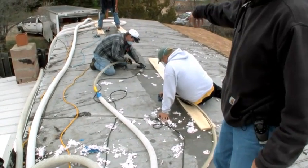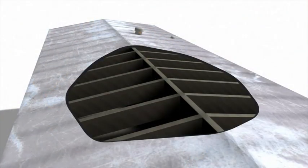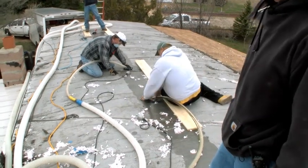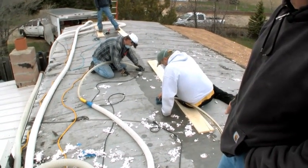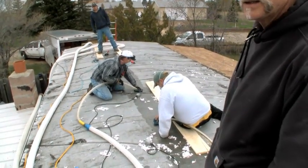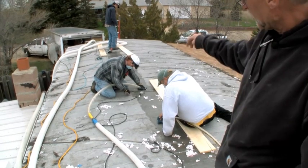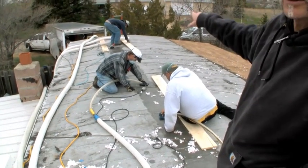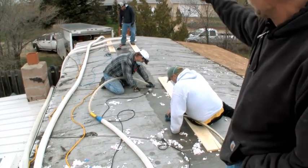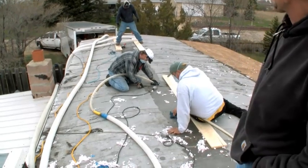One thing to be aware of as we're drilling the holes: a lot of times these older mobile homes have a ridge down the center and you have to drill two sets of holes, one on each side of that center board, because you can't get past it with your tube. This particular one does not have a ridge board inside, so we're able to drill one set of holes and blow both ways per cavity. Other times, if they have a lot of room inside, you can drill one hole and blow an area — we call it shooting around the clock. You start out at 12 and go all the way around an area, go down about six feet, drill another hole, and make sure you're catching all your areas, but you can get by with fewer holes that way.